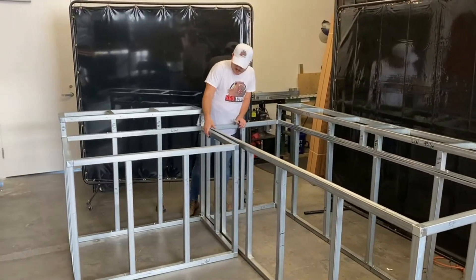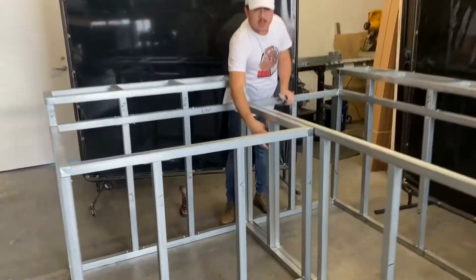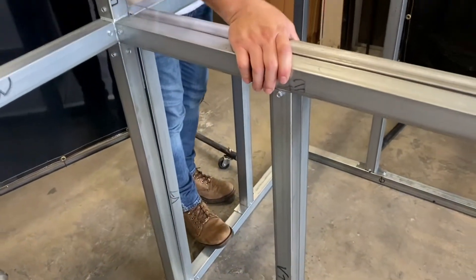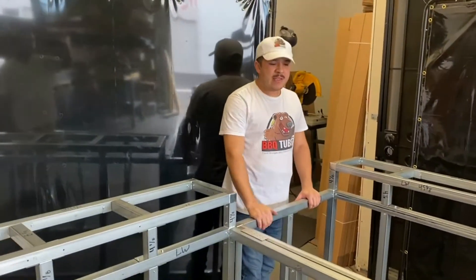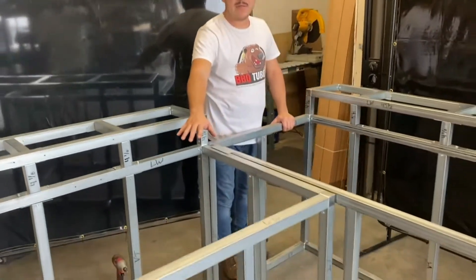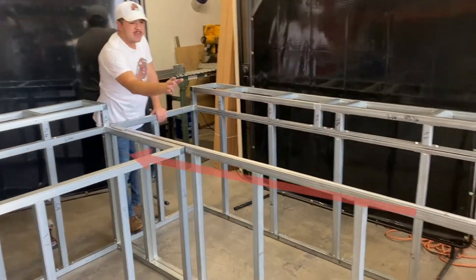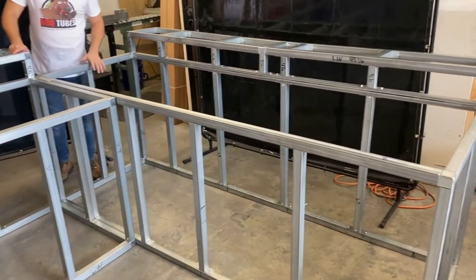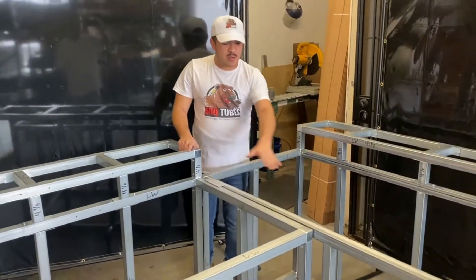We'll bring it all the way up against the eight-footer. We got lucky this time and these vertical tubes are lined up, but you may have to realign your vertical tube later on because you do want them lined up. Just as an FYI — you see how we butted this up against an eight-foot module? We lost this entire space in the front of the eight-foot module, so now you only have space for maybe a grill, a vertical drawer, or a skinny trash drawer. Just be aware of that when planning out your island — you do lose space when you butt two modules up against each other.